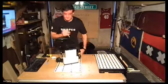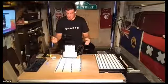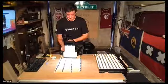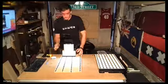That is step one: scan. What the tool now has in memory is that it knows where every square inch of that board is — and that little reticle in the center is representative of the router bit. So anything that reticle is hovered over, you can rest assured the router bit is hovered over too. Right now it's right on the crack, and if I look under the bit, sure enough there's the crack.